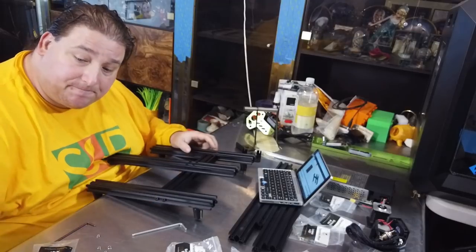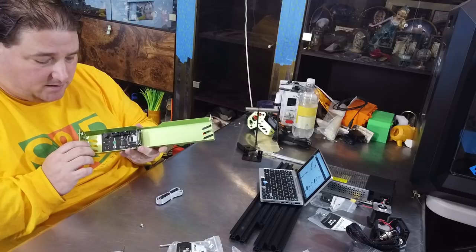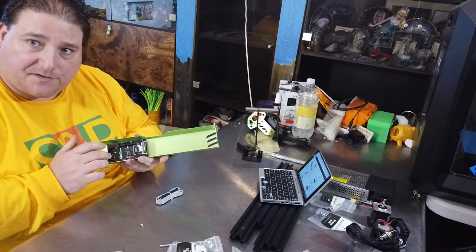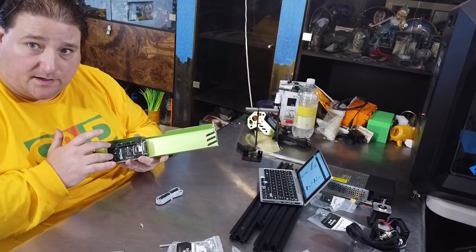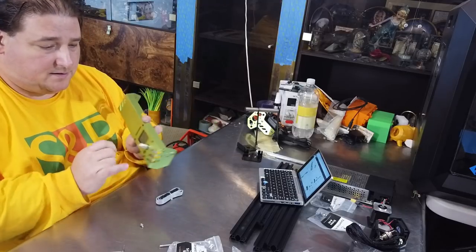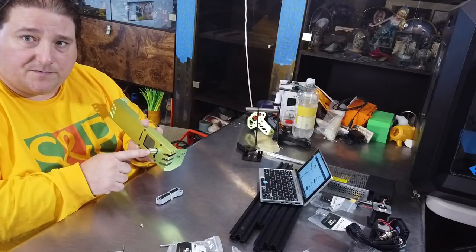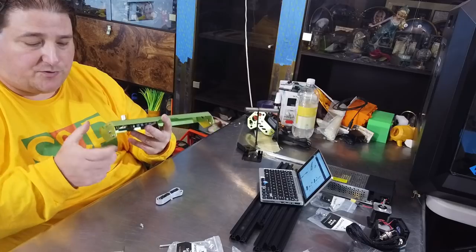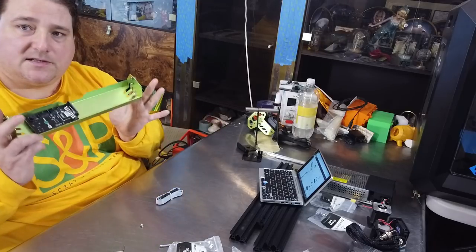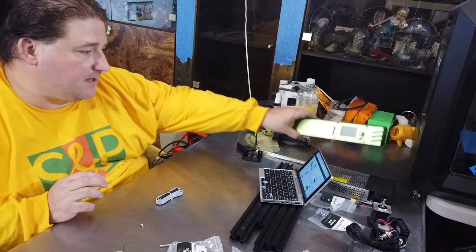The next step was to fit the front facade, which includes the LCD panel. You have brass standoffs and eight screws. Screw the brass standoffs into the LCD breakout board, then the other four screws into the brass standoffs to hold it on the front. You don't have to remove the knob — it fits through the square hole. Preset your four hammer nuts on the sides in preparation for installing this in the printer frame.